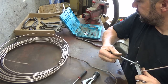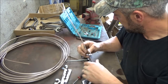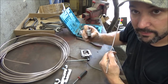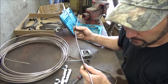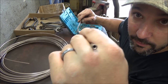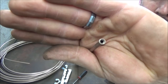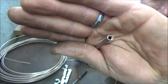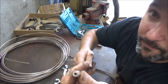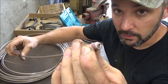Now your flare has to look good — it has to be nice and straight and uniform. If you do enough of them, you're going to get a crappy one that's all cattywampus and cut sideways. It all depends on how you cut it off, so have a good quality cutter. But when you're all done, you should have a nice looking flare like that — hopefully let's see if I can get it to focus here for you. It should be just nice and uniform. You can usually tell when you put the nut on — it'll sit nice and even all the way around, real consistent around the edge of that nut.